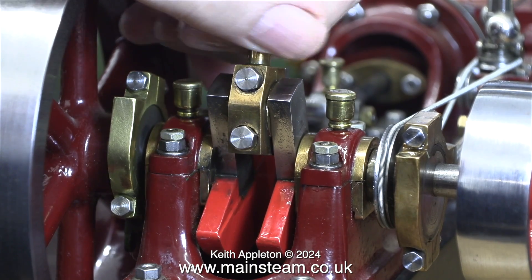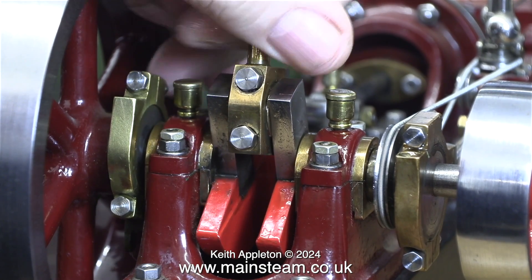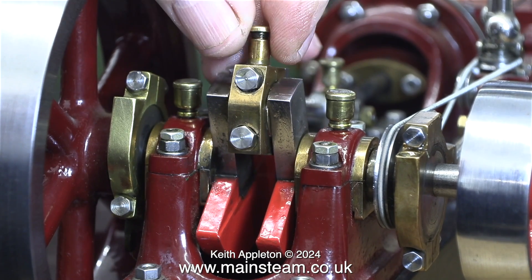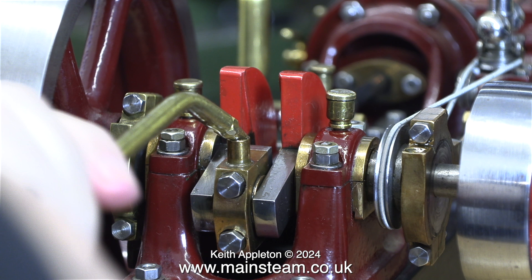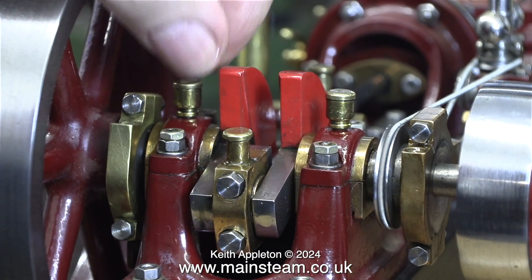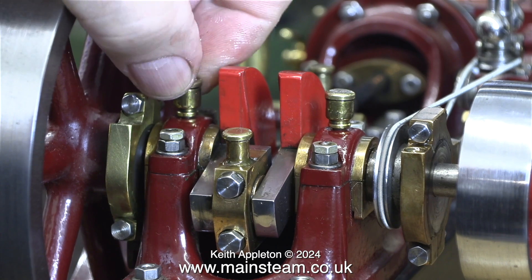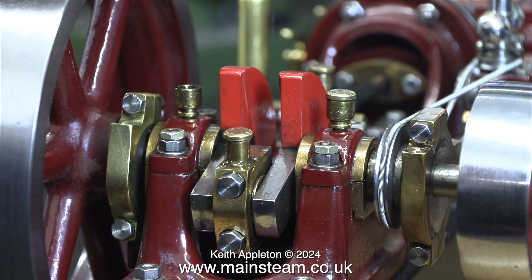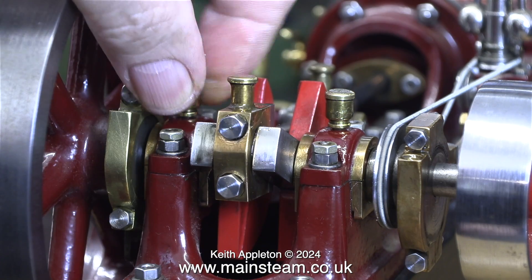What I'm currently doing is oiling all the parts. The caps on these oil cups are quite fiddly — very easy to drop on the floor and very easy to lose. I need to make sure that every moving part of this engine gets an application of proper steam engine bearing oil: not steam oil, not motor oil, and not three-in-one machine oil. This stuff is Hallett Oil's compounded bearing oil — my current preferred lubricating oil.